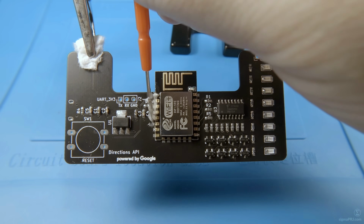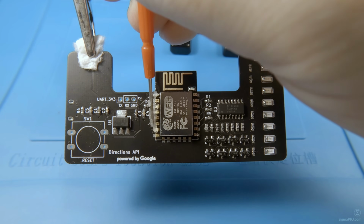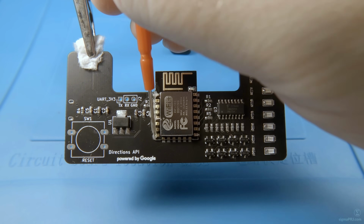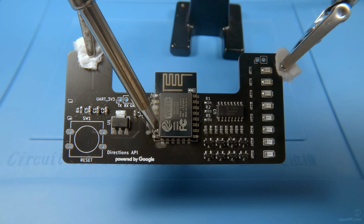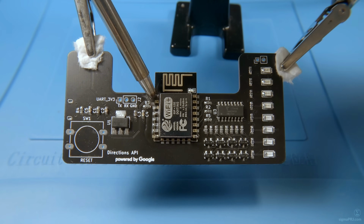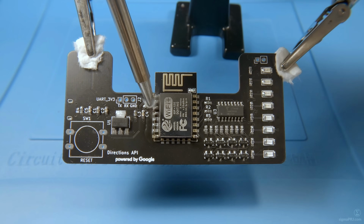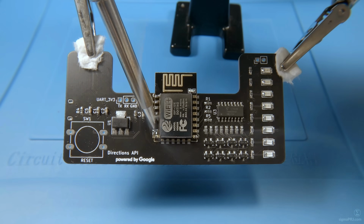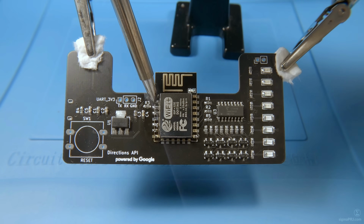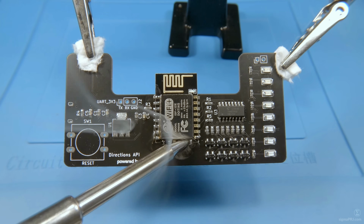And during this soldering procedure, you can think about what is the most convenient way to clean up all of this flux. In case of some types of flux, basic dish cleaning liquid is fine, but in my case, with a new type of flux here, I have found that glass and windows cleaning liquid works more efficiently. This is where the main ingredient is spirit, and of course you can always use isopropanol alcohol.